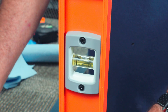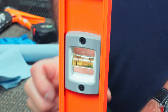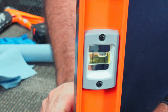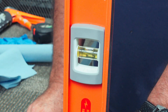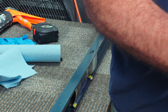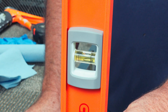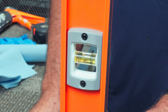So just real quick — the vertical vial is basically the same exact thing. You want to check it against itself. Here we have the bubble touching the right side. Flip it this way — that way we're checking it against itself — and our bubble is touching on the right side just like it was the other way. Flip the level, because there's usually two of those vials on each level, and we have the same thing. Flip it — so this level is good.